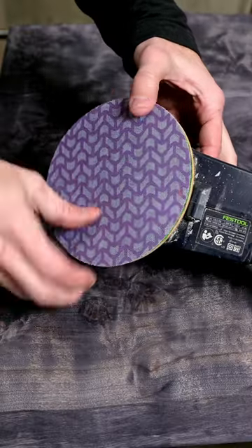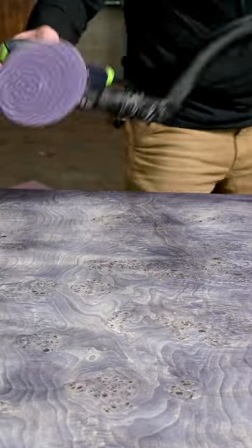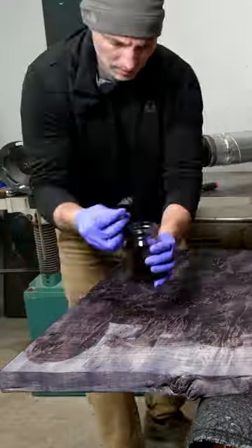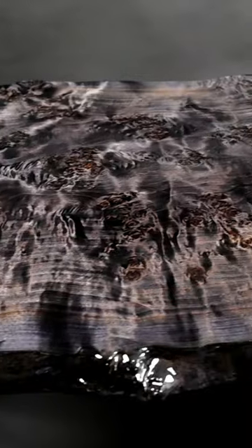The luthier told me that tap water is definitely the way to go. What I do is mix up a pretty dark batch and then sand it off lightly — this is called back sanding. Then I use a slightly lighter batch and come back through the next step, and what that does is give it this really 3D cascading effect, which looks amazing in my opinion.